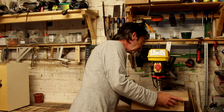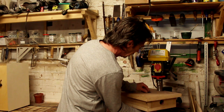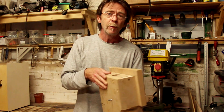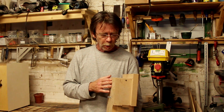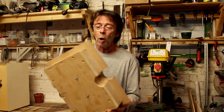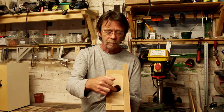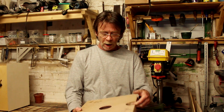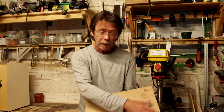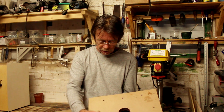We have the templates, the bobbin which does the sanding, and the table with a dust extraction device. The table is very simple construction, made with MDF - fairly weighty, fairly sturdy - I think that's 22mm MDF. The box on the bottom has been made deep enough to take the dust extraction; it has a port for the vacuum to take the dust away. The top is 30 centimeters by 40 centimeters, large enough for the type of work I'm going to be doing.